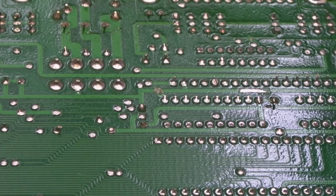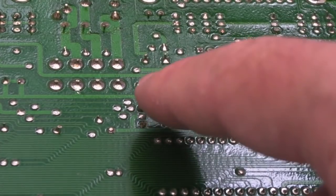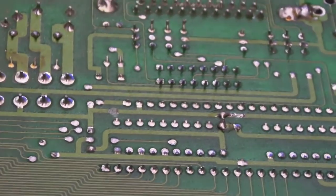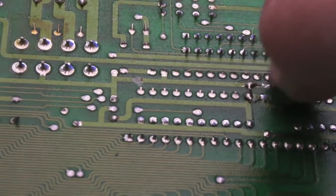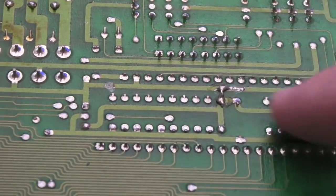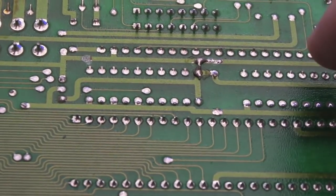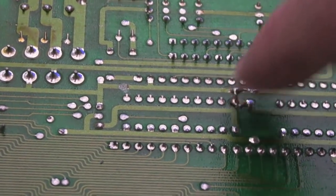So I've had some sort of mod done to this board. I've got another one of these boards and I'm just going to look at that board to make sure it's not been modded the same way — and this is some sort of factory mod. I'm suspecting the 5 volts is not getting to where it needs to be because of that break. Yeah, it's a factory mod. You can see here we've got a cut there, and then that's bridged across — this is how you know the revision has been done. So for whatever reason this rail has been cut, but that needs to be in place, so I think we need to put a bridge like this one has.